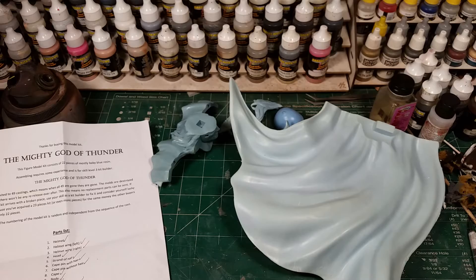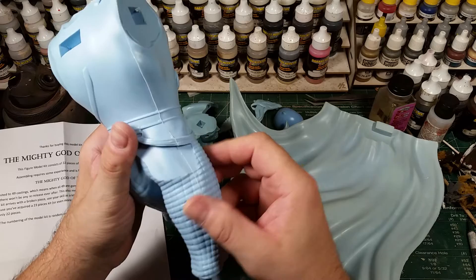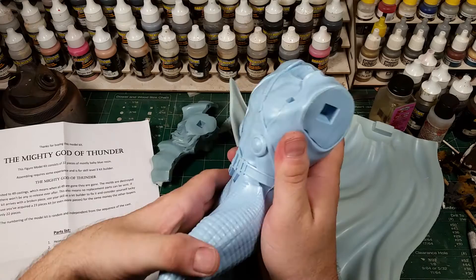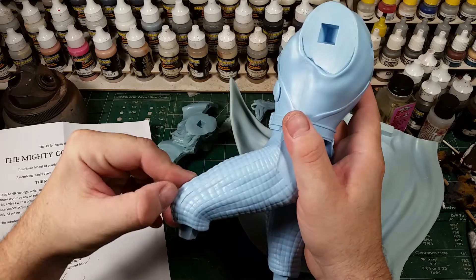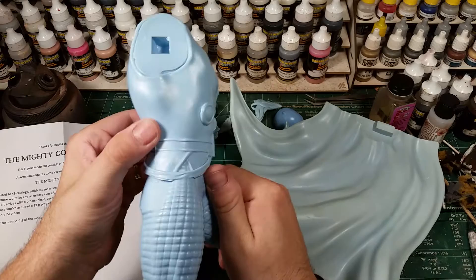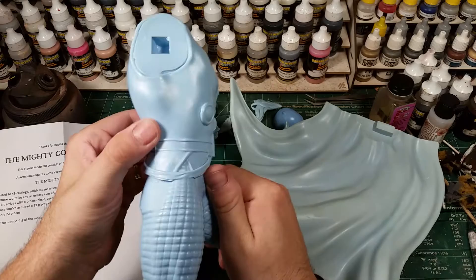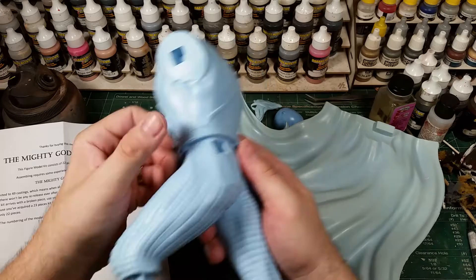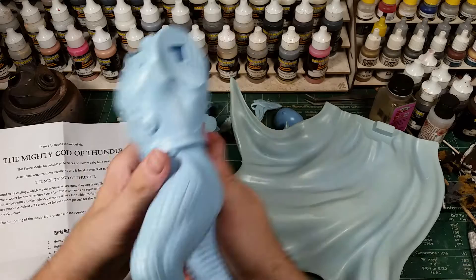The body is one big solid piece — this is color number two. For the most part this casting is good. There is a decent step right here that has to be taken care of, which isn't that big of a deal honestly, because this piece doesn't have a ton of detail — it's pretty simple, classic Thor, so not a ton of intricate detail. Normally a step would be a bigger issue if there was a lot of intricate detail because that would all have to get sanded and re-sculpted. That's actually a step where the mold slipped — you can tell the whole mold kind of slipped slightly during casting. But again, it's not that big of a deal on this one because it's a pretty simple sculpt.